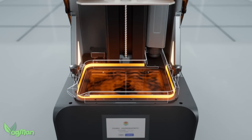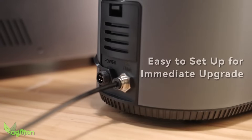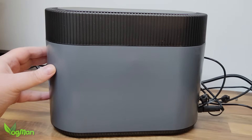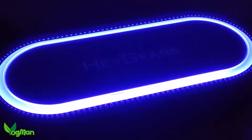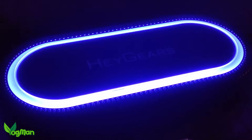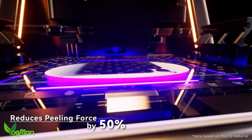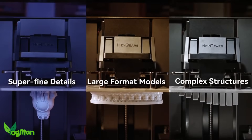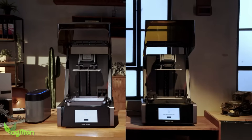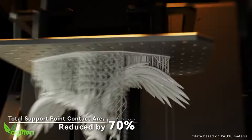One thing's for sure, the heater does work in conjunction with the Pulsing Module, and that's something I think many people will find very interesting. From what I can gather, this surprisingly large device is, I think, an air pump. During use it gives off a funky purply blue glow and suggests that trapped inside it is a Mini Darth Vader using the Force. It seems that Mini Darth and maybe air create a cycle of positive and negative pressure within the release film with periodic inflation and deflation. This creates a large peeling angle, reducing the force needed to separate the print from the liner. This in theory should reduce the chance of print failure. What I really like about this is it also reduces the size of the support tips needed, and that again should lead to improved print quality.